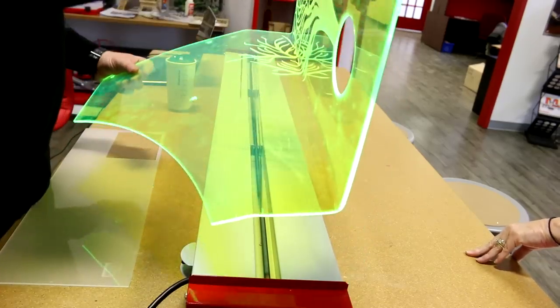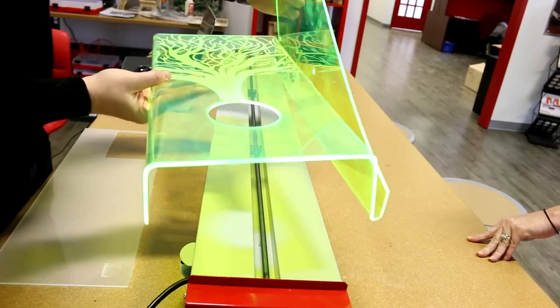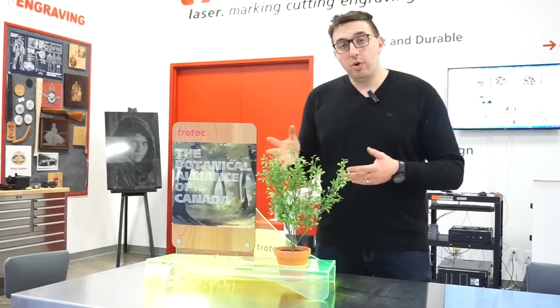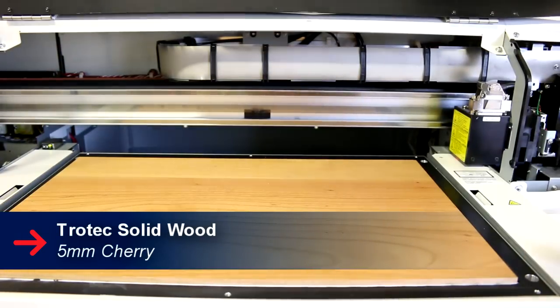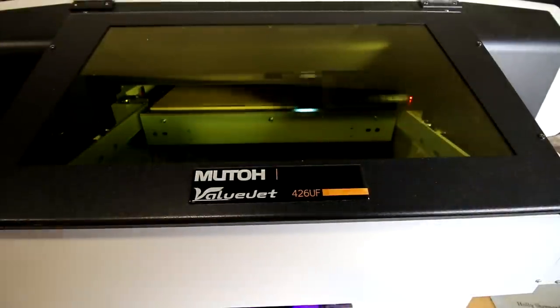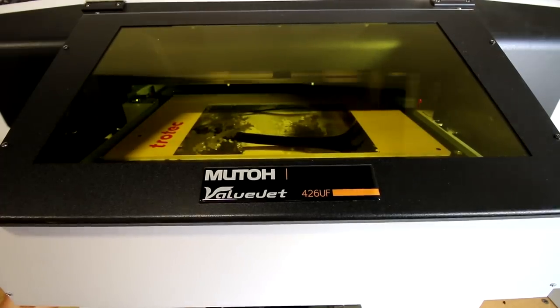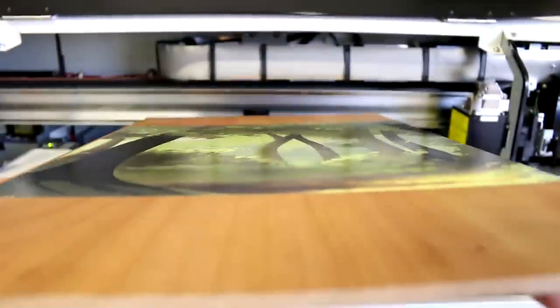First we heat bent the front, let it dry, then the back, and then we sort of have this arching back to our panel. For the wood, we used solid wood cherry. We put it into our MUTO Value Jet 426 UF UV printer and we are printing white as an undercolor so it's not see-through. With this we're printing right on top of the wood, so it's color on white instead of white on color like we do with acrylic. We make sure we have our black registration marks that are a quarter inch in diameter — RGB black filled with a hairline outline that's RGB black as well.